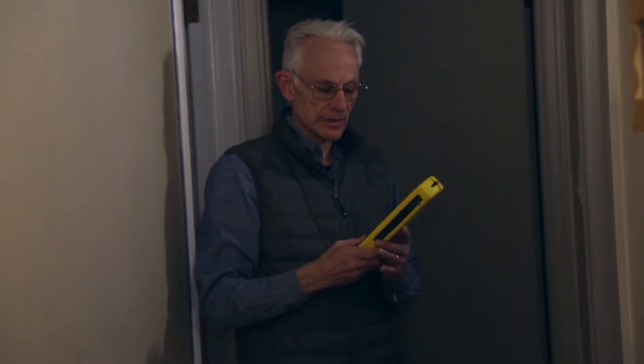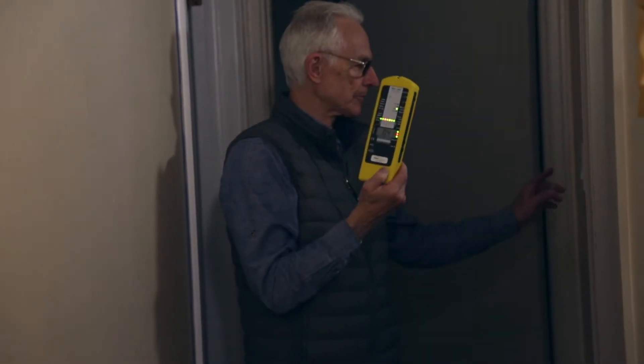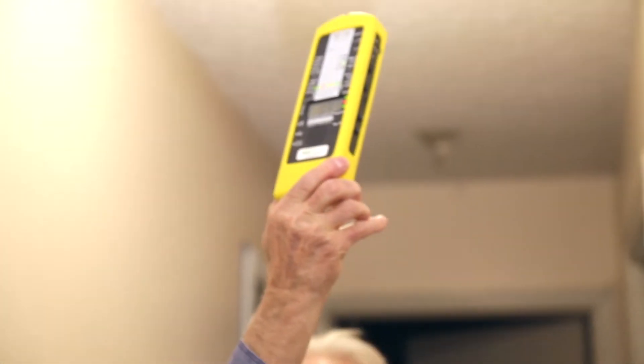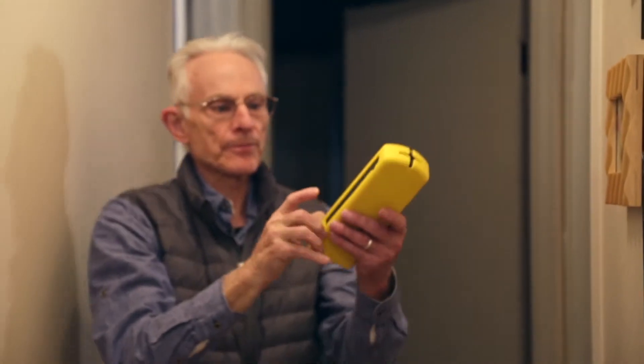We can do this again — if we turn the light on, the fields go up and as we move down the hallway that continues to suffuse the entire hall. These types of wiring errors, where we have unequal current flow on one of the wires or several of the cables, can result in fields affecting larger areas of the house than you might expect.